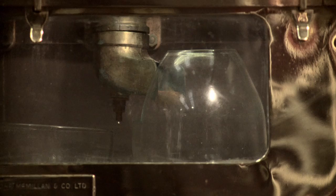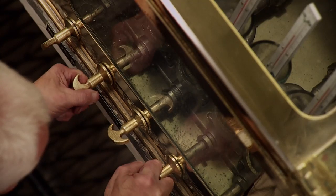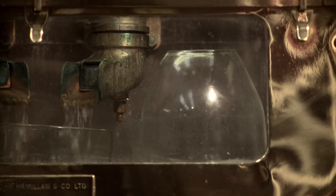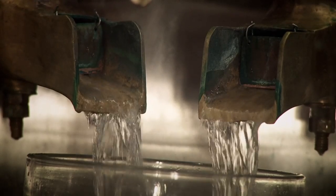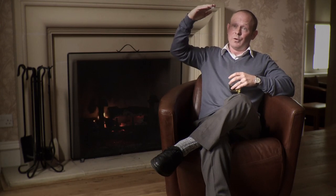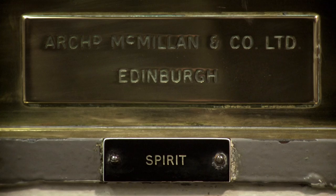As soon as the stills start running, I reduce the flow rate to 5 litres per minute maximum, which is very slow. Other distilleries can be 9, 12, 15 litres per minute on spirit. That 5 litres just gets the right congeners — which is the taste, the smells, the flavours of the whisky — pushing them with the right weight over the neck of the still. At 6 litres you're pushing some of the heavier ones over; if you went down to 4, it's only the lighter ones getting over. So that 5 litres is key — it's the absolute optimum to get the Glengoyne spirit character coming through.